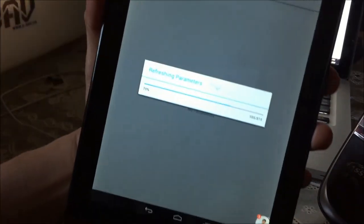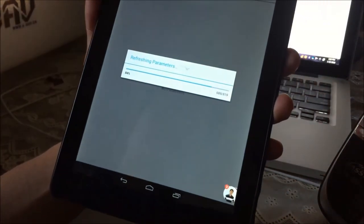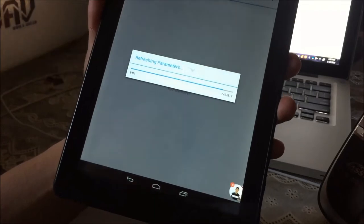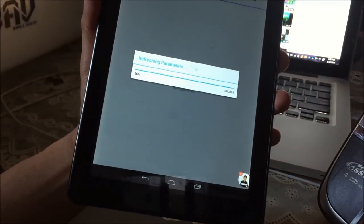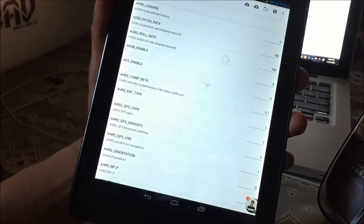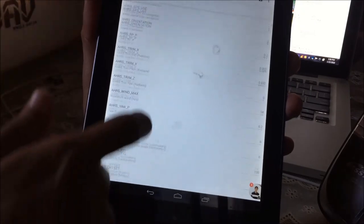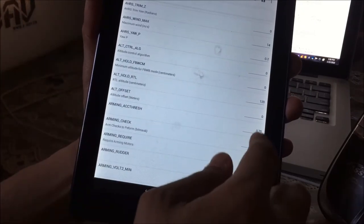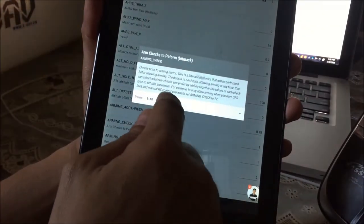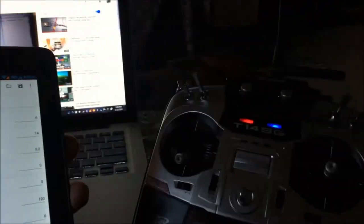It's working on my Android tablet. After this I will try setting it up on Mission Planner. We now have the entire parameter listing loaded on the tablet, so I'll try disabling the arming check first — set arming check to None, then Upload. We have a green light on my Pixhawk 2, meaning we're good to go and good to fly.